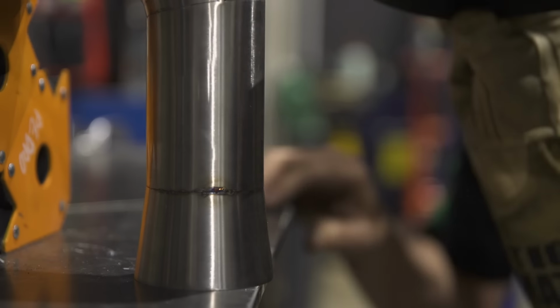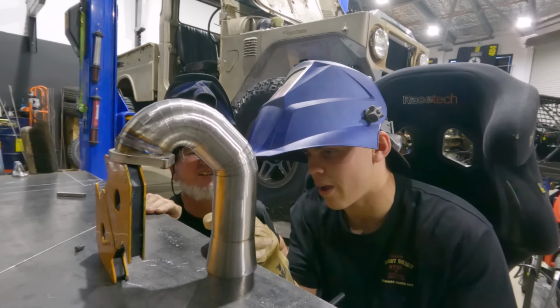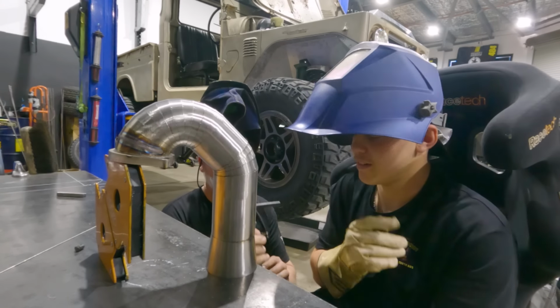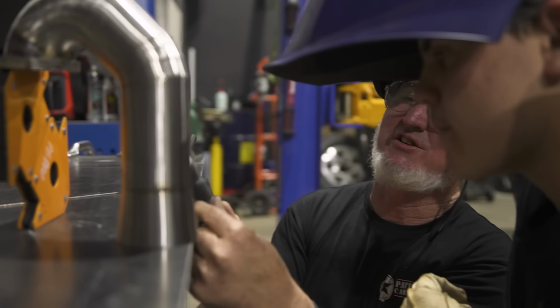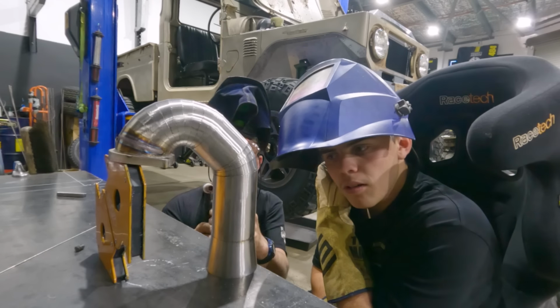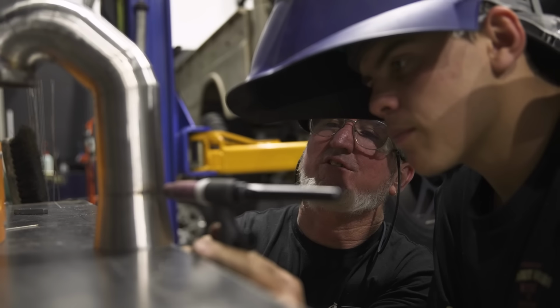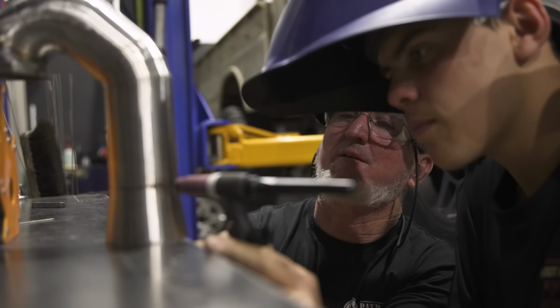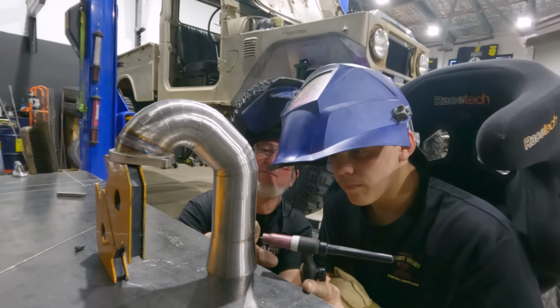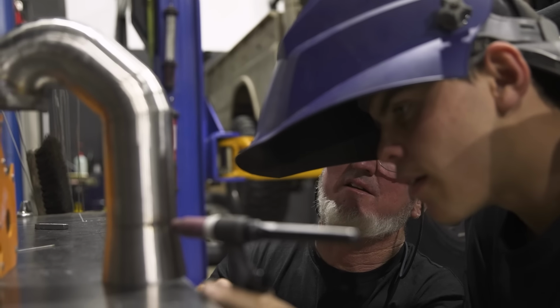That's hard, to watch how the puddle's going, but also watch where you're going. You've got to watch on the side you're coming, to see that line. Same thing, you've still got to start that way, but you've just got to hang around, get your puddle. Yeah, because you're going right there, but see, you've dropped down, you've missed that bit. Yeah, exactly.